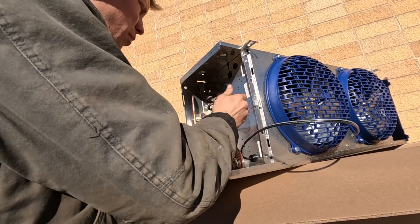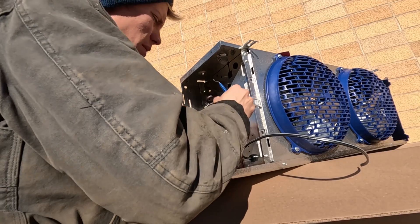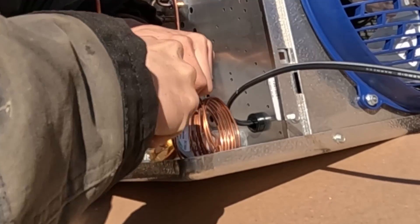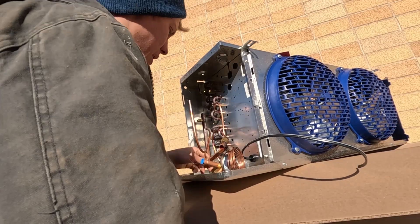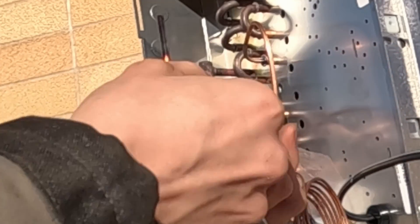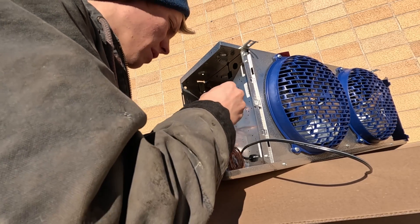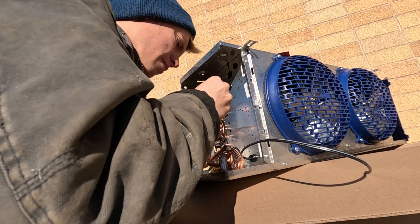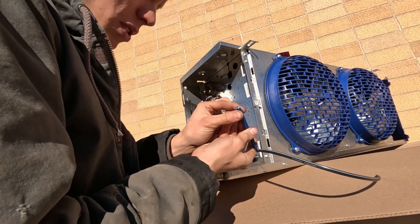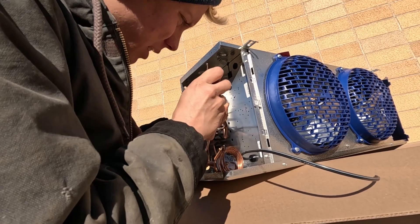These evaporators are shipped with a little pre-purge of nitrogen. We're going to deburr the pipe — be careful not to let that burr fall down into the pipe. They also send a little snap disc. I like to put the nozzle so the one-half part is facing up, so that if you look down in there you can confirm what's installed. I'll use the end of my deburring tool to pop the part off and press it down.